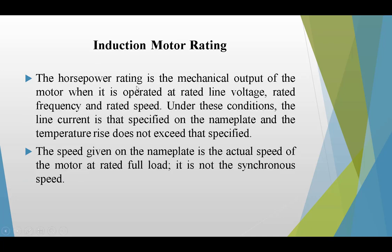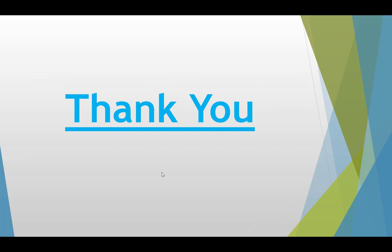The horsepower rating is the mechanical output of the motor when it is operated at rated line voltage, rated frequency and rated speed. Under these conditions, the line current is that specified on the nameplate and the temperature rise does not exceed that specified. The speed given on the nameplate is the actual speed of the motor at rated full load. It is not the synchronous speed. So keep it in mind that the speed provided on the nameplate is the actual speed of the motor at full load and it is not the synchronous speed. Thank you.